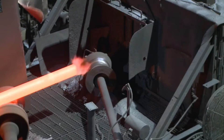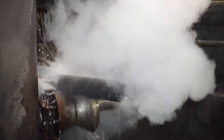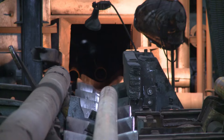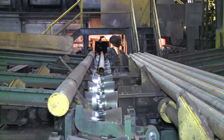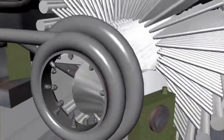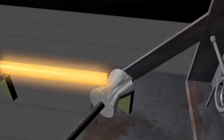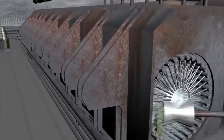Here, the specified strength, hardness, microstructure, and impact properties required of high-strength tubular products are developed. The pipes are transferred and loaded into the walking beam preheat and quench furnace, where they are heated to 870 degrees Celsius. Once reheated, the pipes exit the furnace and pass through a water spray quench unit. The unit has seven spray quench heads, each consisting of 800 individual water nozzles. High-pressure water from the quench heads is evenly applied to the tube as it rotates through the machine.